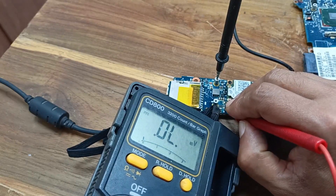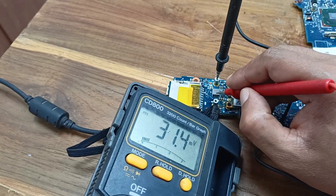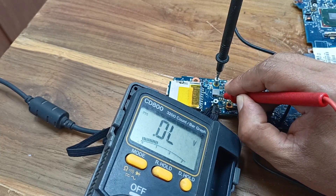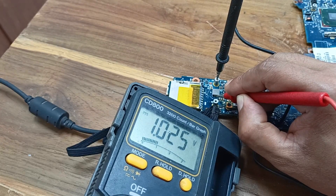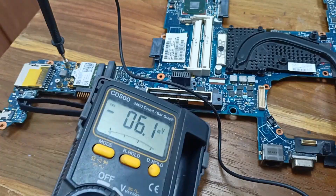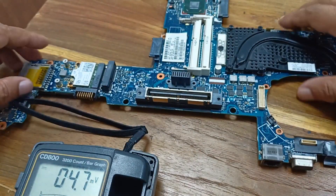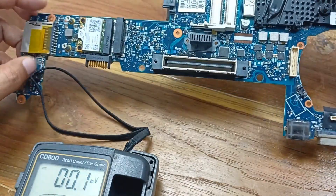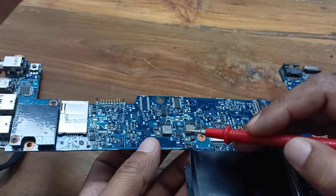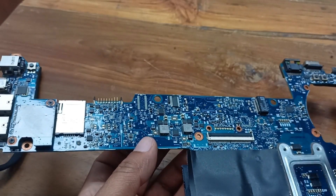Here is one resistor and 19 volts present, and this MOSFET may output 1.1 voltage. Let's check it — yes, here is 1.25 volts present also. That means this MOSFET is also working. Now I need to find out the 3.3 volt and 5 volt. This area is working for the 3.3 volt and 5 volt, which are very important voltages for this circuit.